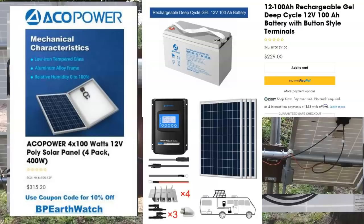You're going to need six batteries total, and you're going to need an inverter. The inverter will take the DC voltage from your batteries and convert it to AC, so you can use it in your camper or your home. I'm about to add four more panels and go up to 1600 watts, but 1200 watts will do a lot. With the right inverter, you want a pure sine wave — I'm going to go into that in detail in the next video.